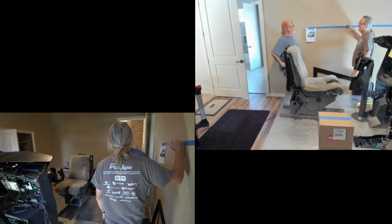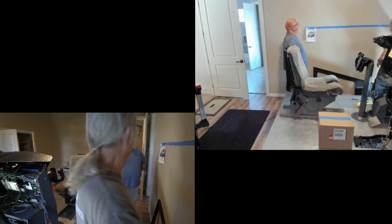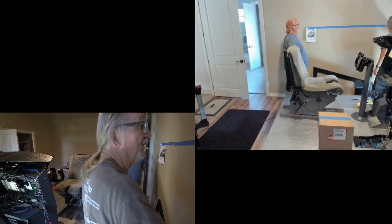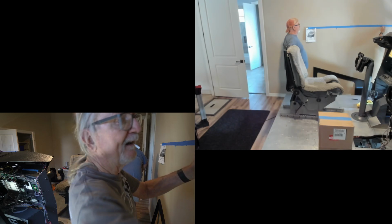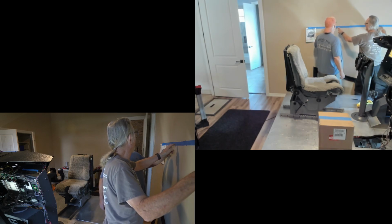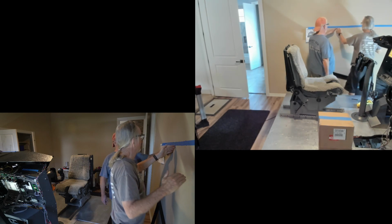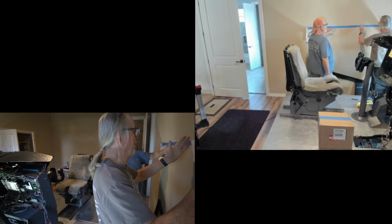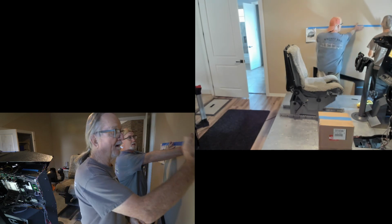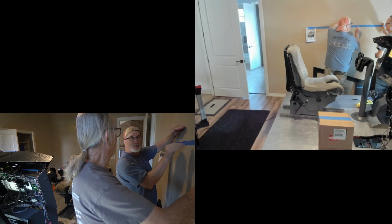Yeah, so I need a bracket here. The problem is I can't mount the bracket here because there's metal back here, because of the service. So the service is between here and here. But I should be able to put a bolt in there. Since the end of the screen goes to here, the bracket's probably gonna need to be centered between that and here. Mine is like right here. But remember, we put a 2x8 across there to give it more support than putting it into the studs.